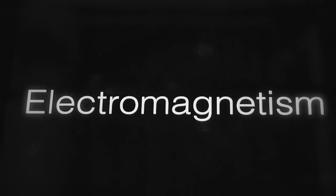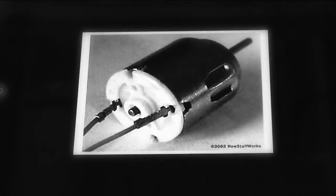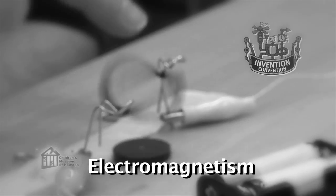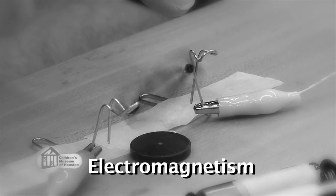Many speakers use electromagnetism to work. You may recall the last time we talked about electromagnetism was when we talked about motors. When electricity flows through a wire, it creates a magnetic field. In the case of motors, that magnetic field can interact with magnets to make a coil of wire spin. In the case of speakers, we still have a coil of wire with electricity flowing through it, but that coil of wire interacts with a magnet to create vibrations.